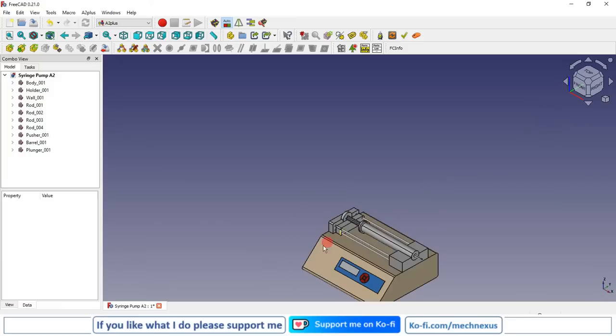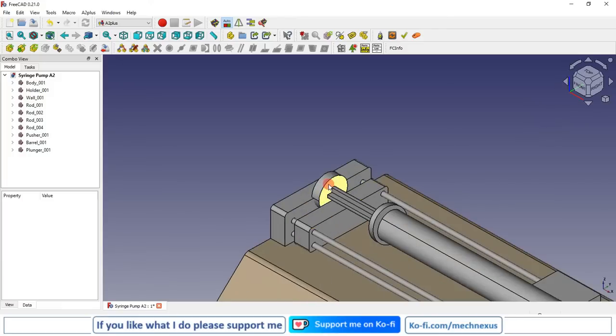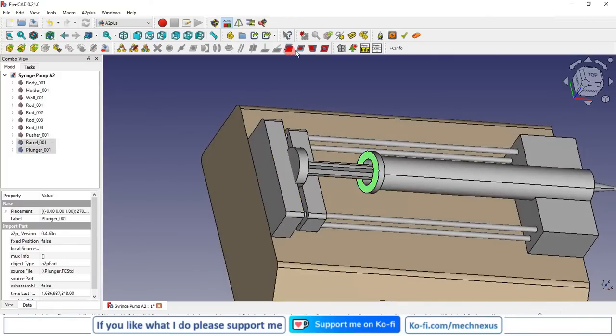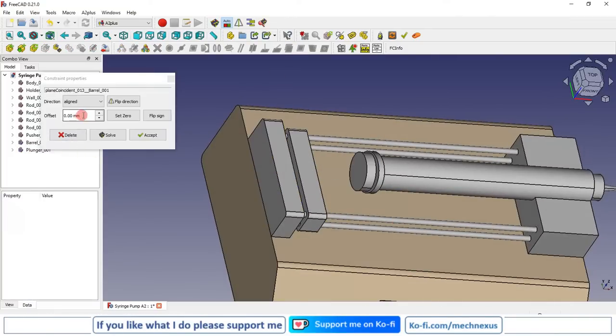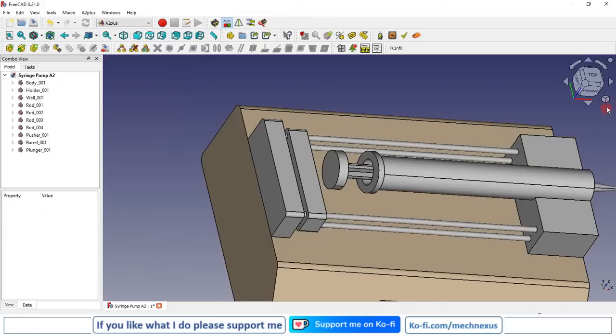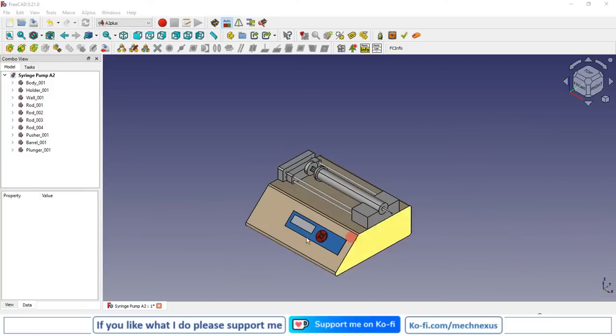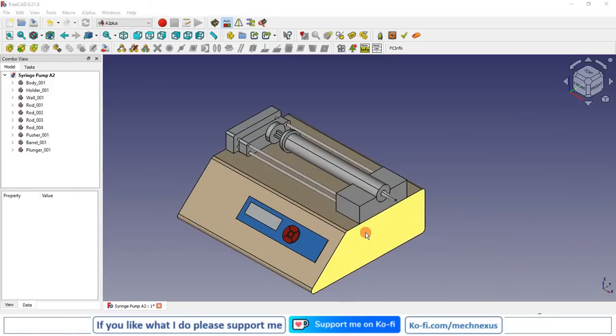Now I will give the distance constraint. First I will switch to the isometric and I will give the distance constraint between this face and this face. So I will select this face and this face and I will give the mate, and distance I will give the 15 mm but in minus direction and I will accept it. Now I will switch to the isometric view. So this is how we have made the syringe pump assembly in FreeCAD.